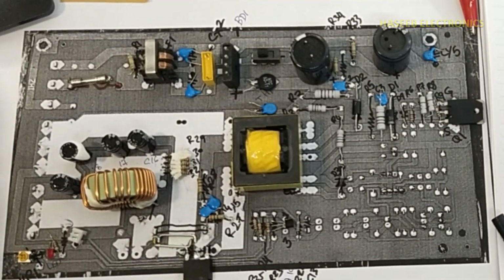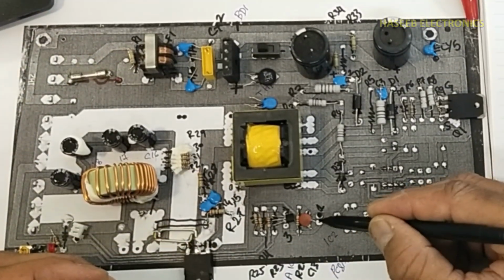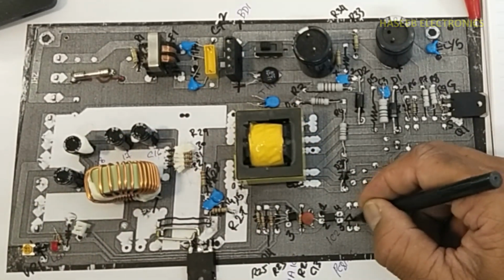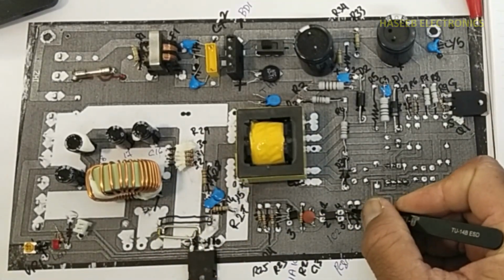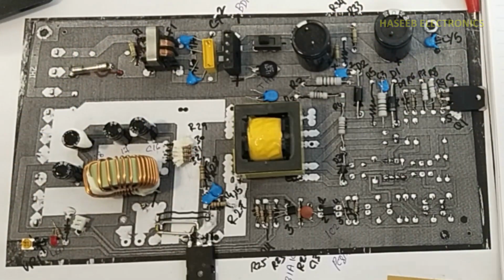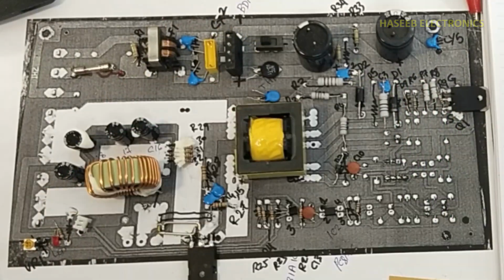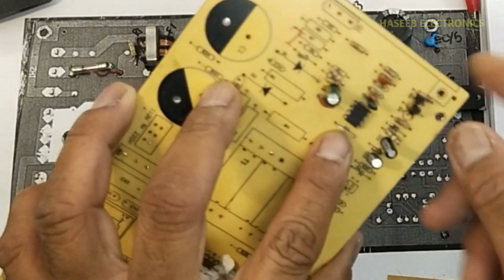104 code, 100 volts, IC 2, 817C, 1, 2, 3, 4. Here we have a diode and resistor, D6, 1N4148, R20, 2.6K. Then one capacitor here, 104 100 volt, PF code. Then we have another capacitor here, it is C9, same 104 code here. Then here is a jumper,